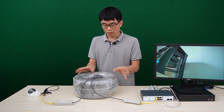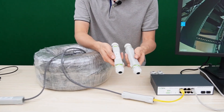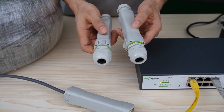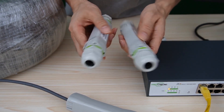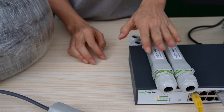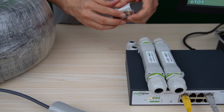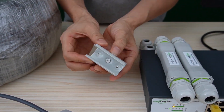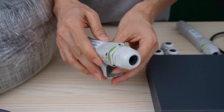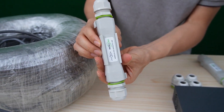If we need a second run, we can add another pair of PoE extenders working with a second port from the regular PoE switch. These extenders can snap together and it's quite easy to place them on top of the regular switch. You can also use a DIN rail mount or a wall mount bracket — just insert the PoE extender and mount it on the wall.